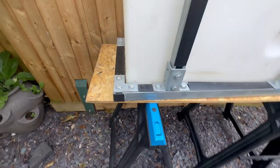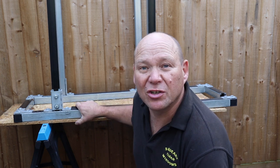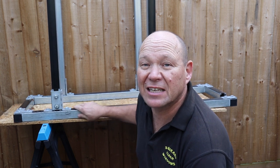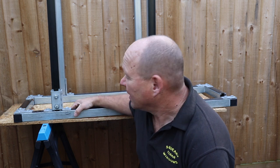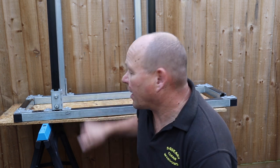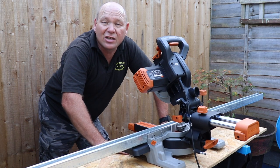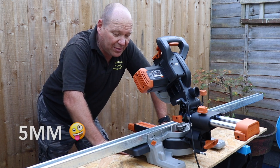With it being so easy to make, I've ordered it all up. To start with I'm going to make the frame that goes around the bottom of the tank. Before you start it's always worth double checking that your frame is the same size as stated in the advert, because you don't want to cut up a load of metal and find out it was actually a little bit bigger. The width of the tank is 1 metre and 30mm, so I'm giving myself an extra 5mm on that - so 1 metre and 35mm.